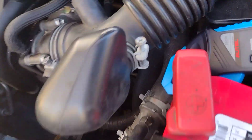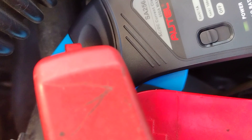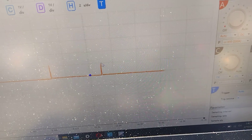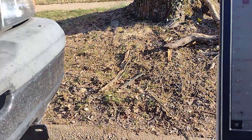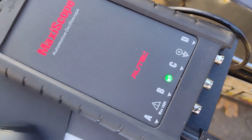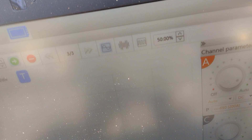The first thing you want to do is make sure your clamp is on. As you can see, the battery is on. Also make sure you zero it — press right here — and make sure it doesn't get stuck, just keep pressing. Then make sure on your oscilloscope that it's at zero. In this case you can see it's at zero. Also make sure you have your attenuator hooked up — you can see the green light.